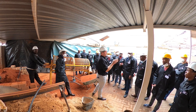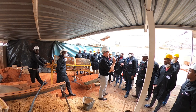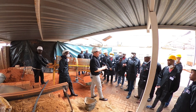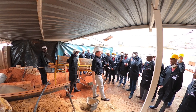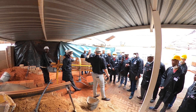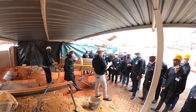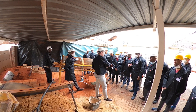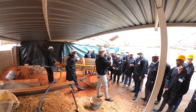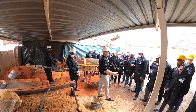The best pH for Portland cement is 6.5 — the neutral is 7. If you're using Portland cement, 6.5 is ideal. So that's the first and second wheelbarrow done. We'll start the machine, let the mixer turn, put in the first wheelbarrow, then do the bucket of cement, and then put in the second wheelbarrow. Always let the sand break down the clay a little bit first, then you add the cement, and then you add the other clay.